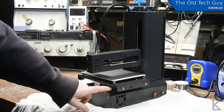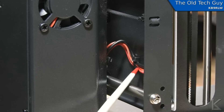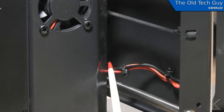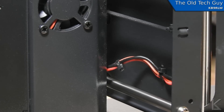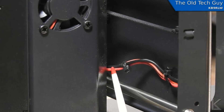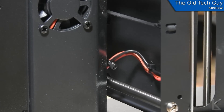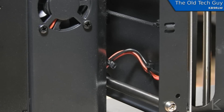Here's the bottom of the carriage that the bed sits on. You can see the two wires come through this grommet from the bed, twisted a little here — they're almost fully stretched out and have pulled up out of this grommet. Right here is where it's going into the chassis and you can see it slides in, slides out. I'm starting to see a little bit of shine on the insulation here where it's rubbing against that grommet. When it goes in the other direction and those wires curl up, you can see how much flex is going on. It curls right up and then slides down into the grommet further. That's just rubbing and flexing and these wires are going to fail eventually — that's what we're trying to solve here.